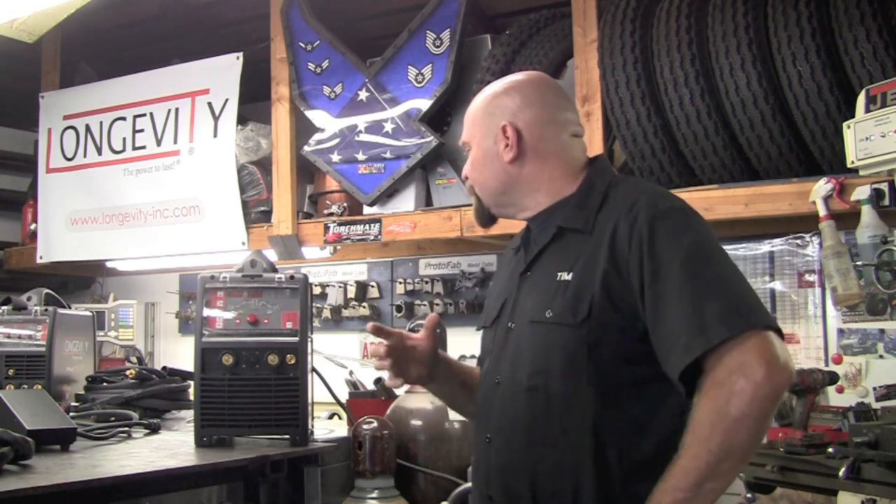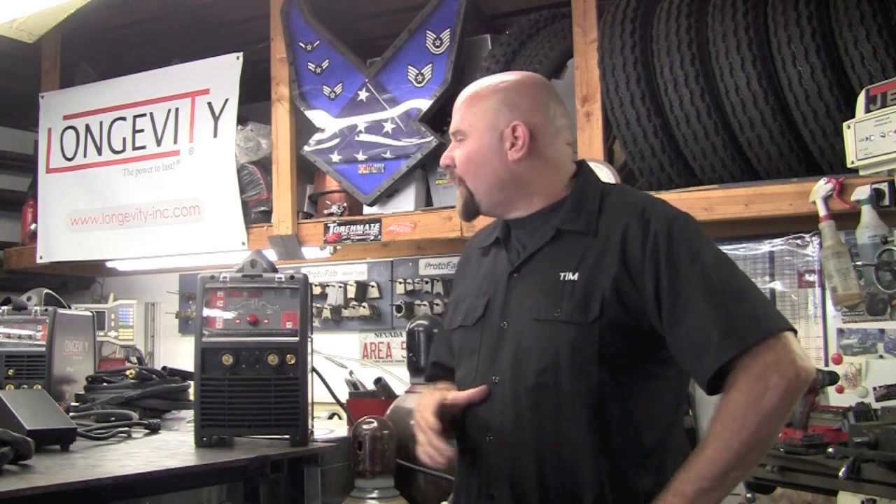So I was sent out this 200EX to test and given the option to trade it for my DX. The DX was such a proven performer, automatically in my mind I'm saying, no way. I get this new machine and the first thing I notice is it's a full synergic design. Synergic means that it uses a small microprocessor that works together with the hardware in the unit to give you the best optimum weld puddle. It was very evident the first time I used this machine that it was just the next generation up. The DX is still a well-proven performer, but the EX just tops it off just a little bit.